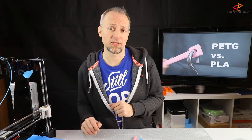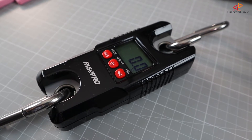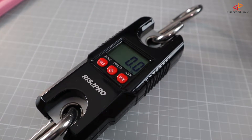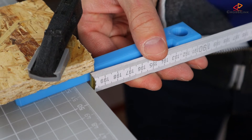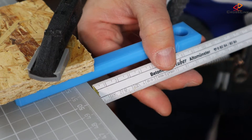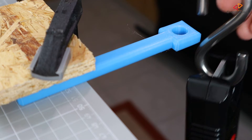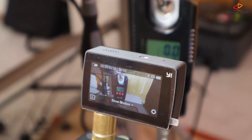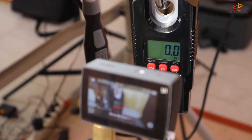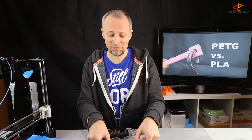The crane scale can hold up to 300 kg, so it should be suitable to see how much weight the sticks can handle. The end of the first PLA stick is fixed to the table using bar clamps. The protruding length over the table edge must always be the same to have comparable conditions for all test candidates. Then the crane scale is hooked into the loop at the end of each stick, and the other side of the scale gets hooked into a loop where we can pull. My action cam is set to high speed recording at 120 frames per second to catch the moment when the sticks break.